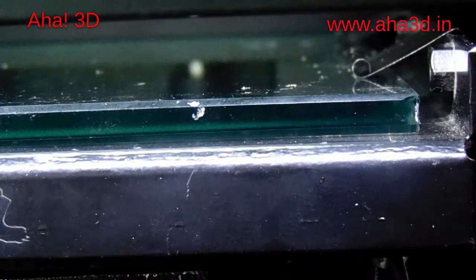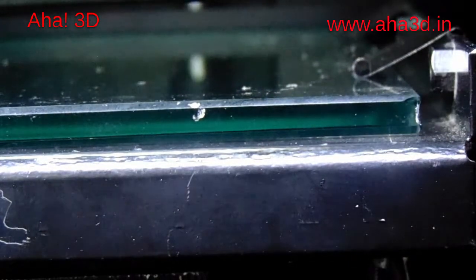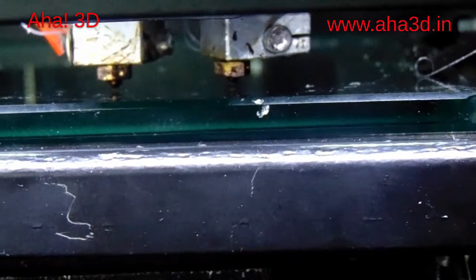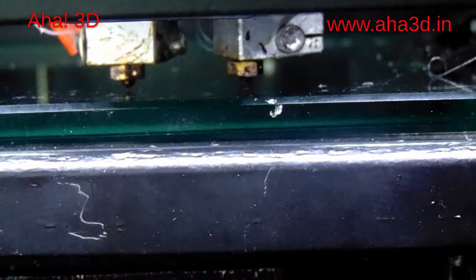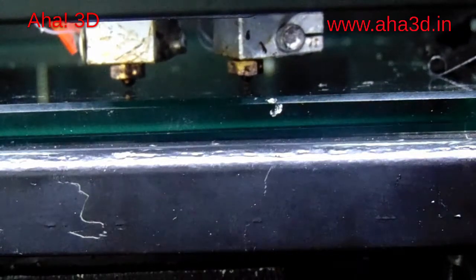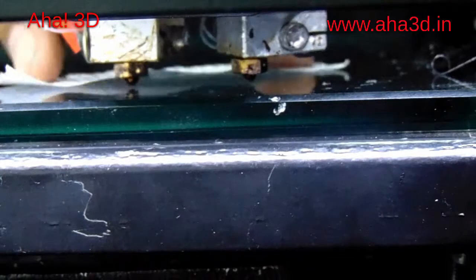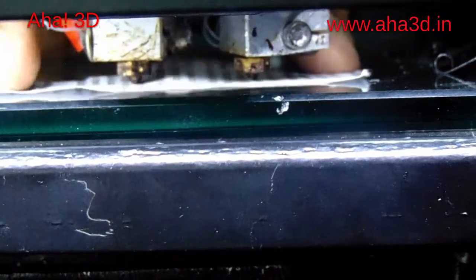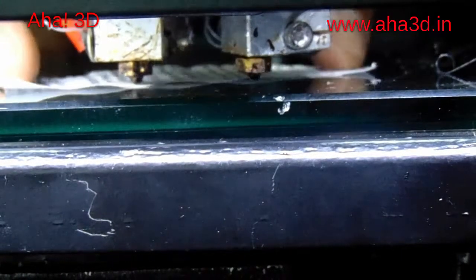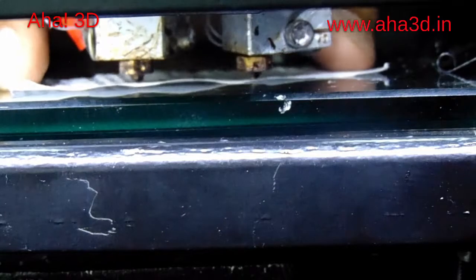In the similar pattern, we will select the option of corner 2. After selecting that option, you will see that your extruders are moving to corner 2, which is the front right corner. As you can see on your screen, the extruders are right on the front right corner. To check the bed level at corner 2, we will again take a sheet of paper and insert it between the extruders and the bed. As we can see, it is inserted easily and removes very easily, so the distance between the extruder pins and the glass is a bit more — we have to decrease it.